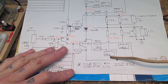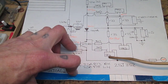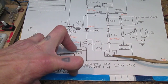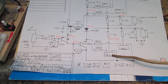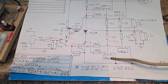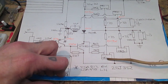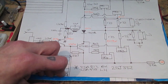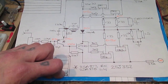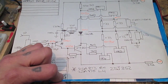And then also, to further complicate things, having looked into lateral MOSFETs a bit more and done a bit more research, all MOSFETs are pretty notorious. In fact, all transistors are pretty notorious because they have such a high gain up to frequencies into the VHF, very high frequency, so they're prone to oscillation. And that's why we had that burnt out Zobel resistor on the good working channel.